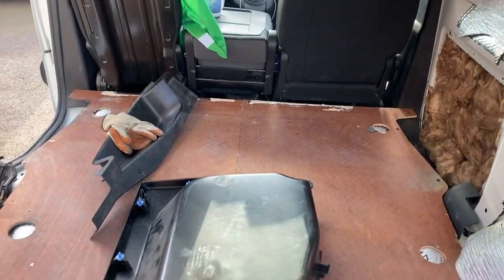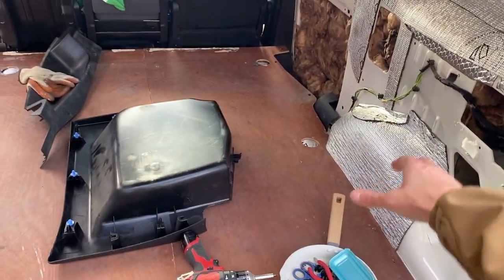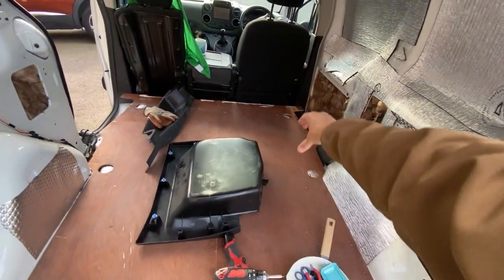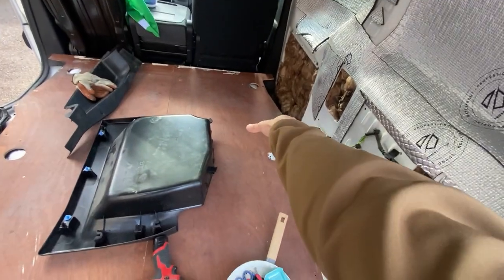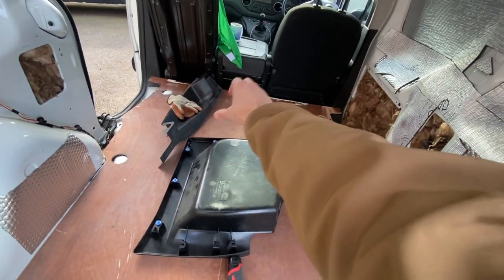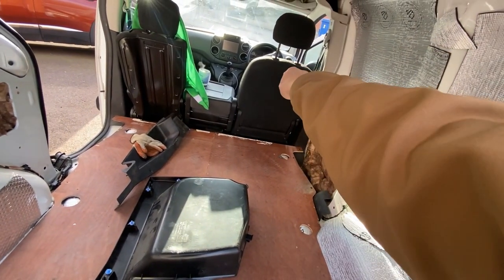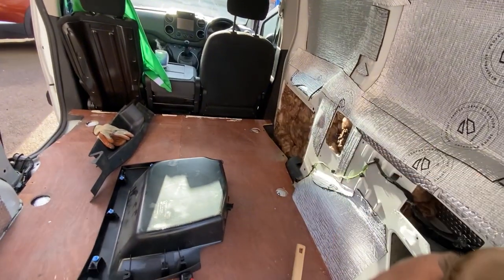Then we get into where the bed's going to go — either this side or this side, I don't know yet. The plan is the bed will run long like a bench chair, traditional. It's going to have three partitions that can go to an L shape here, L shape here, or middle out. It'll also open and close to access storage. Halfway, one part of storage can come out as a drawer; the other part comes inwards for access, and you can also lift it up. The top of the bench will have an extra folding flap that you lift when you go to sleep, place onto the chair which folds flat down, and rests on the back. Eventually it'll be a swivel so you can turn it and rest it on the seat, giving you full length for sleeping. When you're done, fold it back — it's a chair again.